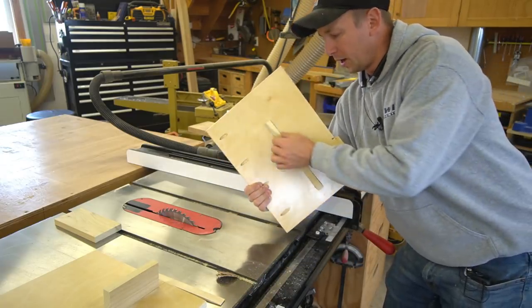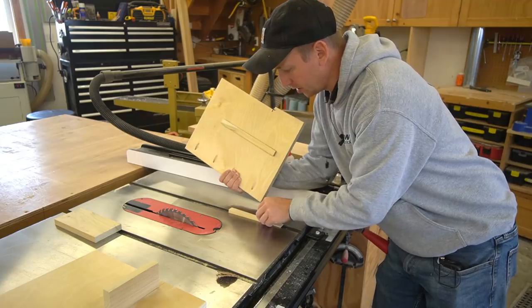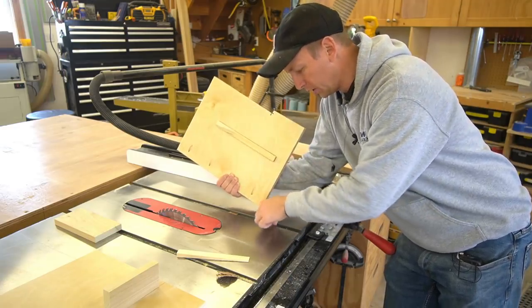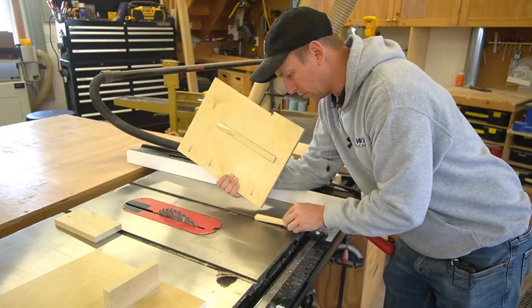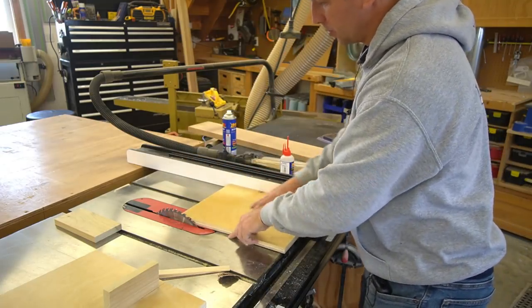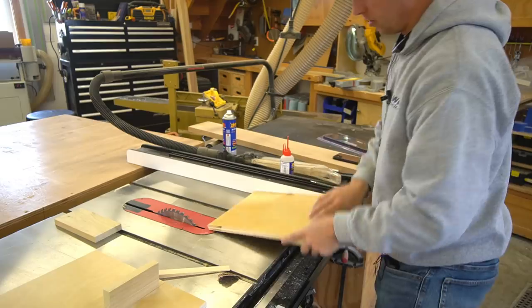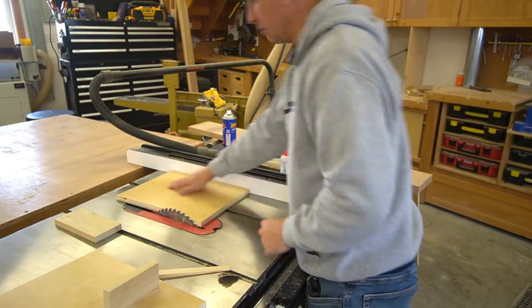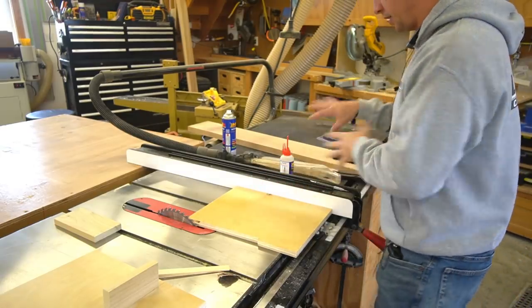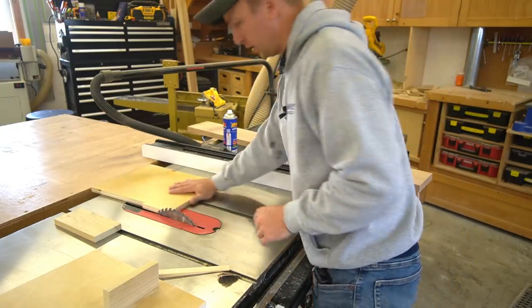Now I've got my piece of guide here glued on. What I did was just drop the piece down into the channel, and since I had it ripped at a little bit less depth than the channel itself, I put some pieces of cardboard down to raise it up so it was just a little bit higher than the table, put some CA glue on top of it, and then dropped the plywood right down on top and let that set for about 30 seconds before I pulled it out. So now we've got a guide, and this will kind of wear a little bit and get smoother as you run it through a few times. At this point I can go ahead and move my fence over — don't need that to be stationary anymore. You can see how that motion will work.